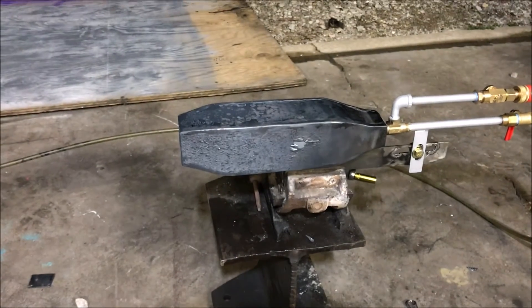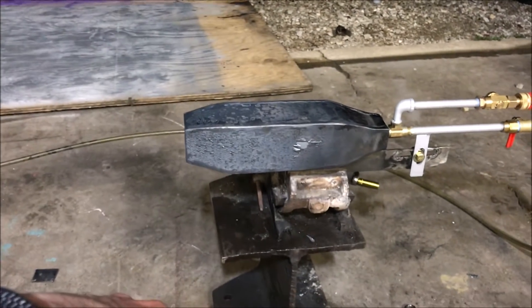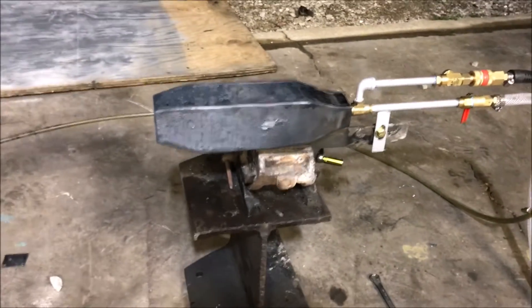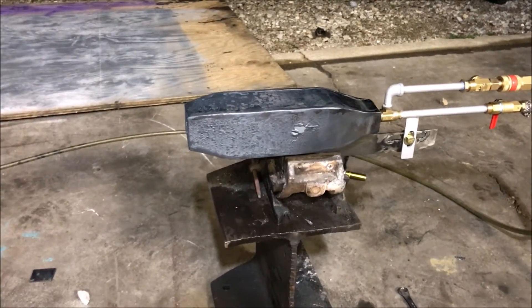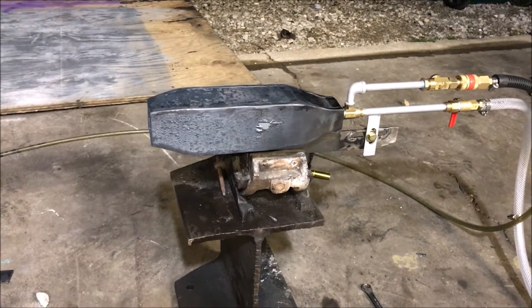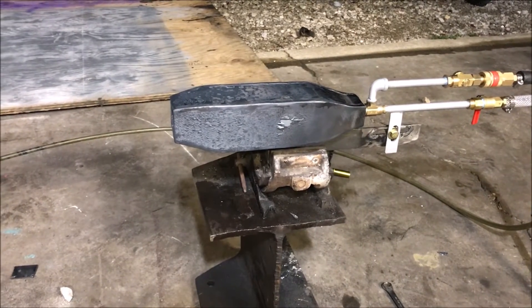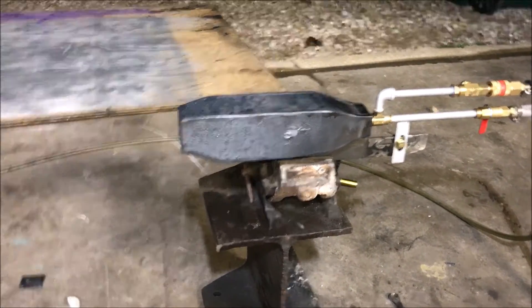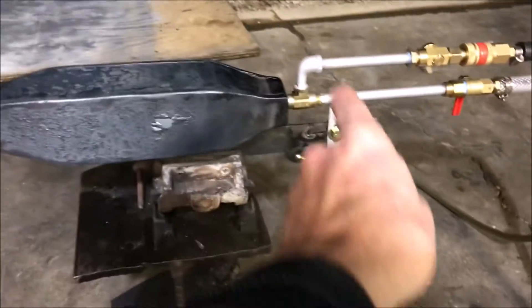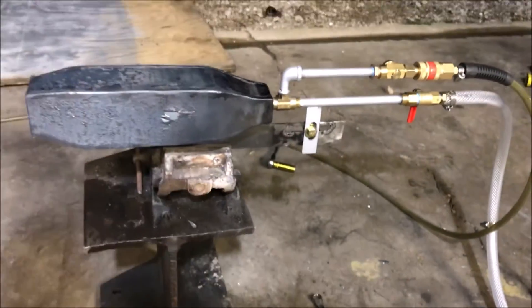It's being blown into fire, but heating those gases up to a combustible temperature takes a certain amount of time — several microseconds. So that IR energy being available to heat these gases to combustible temperature is critical to running this thing at these levels. This is not a spud burner, guys. This is a completely different beast. We are not mixing propane and air in this nozzle — that is not what you're seeing here. Something very unique is taking place.